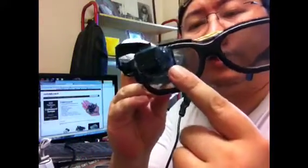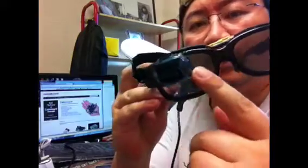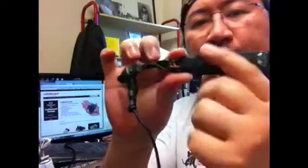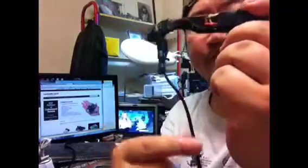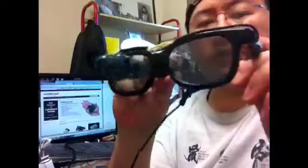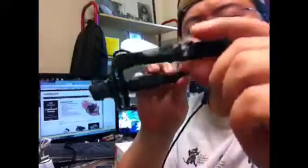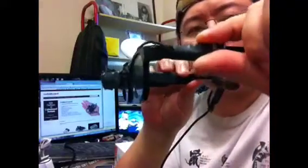One half of the glasses is the LCD display connected via a long enough ribbon cable to the LCD driver board, which connects via a long lead for the input circuit on the other side. These extra wires are just for the brightness and contrast controls, which helps me to see the display on a bright day or not.